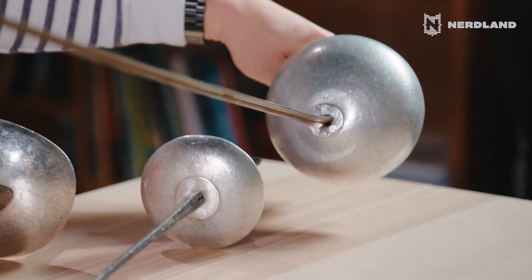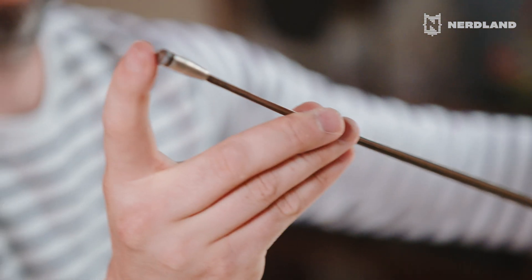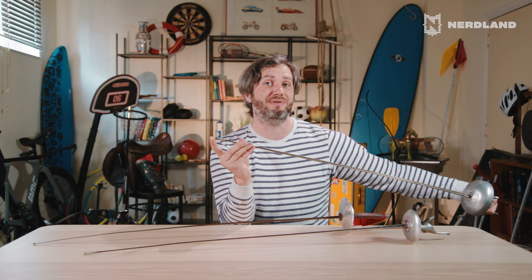The last weapon is the épée. Once again you have to score with the tip and with a certain force, so there's a push button here again. But now you can touch the opponent at any part of the body, so there's no need for a conductive vest. Wherever you push this button, it's okay. The circuit now doesn't go all the way to the other player — it's all very local. There's one wire going all the way up, then you have the push button, and another wire coming all the way down. When you push the button, the circuit is closed and the lamp will light up.